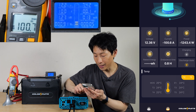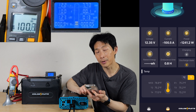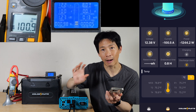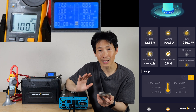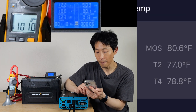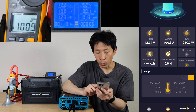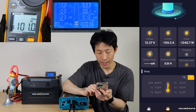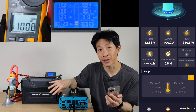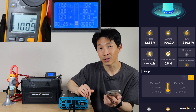At the bottom, there's a temperature reading in Celsius or Fahrenheit. It says MOS temperature, which are the FETs inside — those are the solid-state switching elements that connect the output to the battery. This entire 100 amps is running through those MOS transistors, and you can see it says 80.6 Fahrenheit. As we discharge, this is going to increase in temperature. You also have E1, which I'm not too sure where it's located, and T2, T3, T4, T5 temperature sensors. At least one should probably be on the side of the cell pack, and another should be right on the PC board near the MOS transistors.